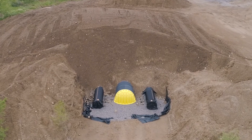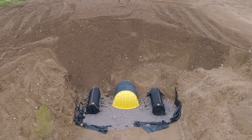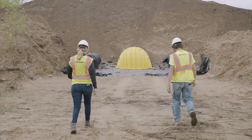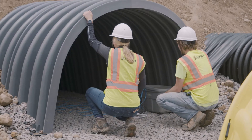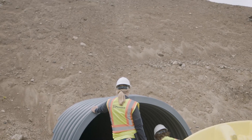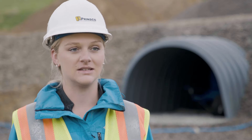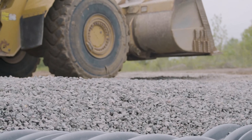We've got dead loading at 17 feet of cover height, which is way beyond the actual limits. We're testing these at over two times the limits for both a live test and a dead test. The dead test is what we call overbearing load — that 17 feet of cover — and then the live test uses very minimum cover heights, less than even what we recommend, and drives axle weights over them that are way more than they'll ever see.